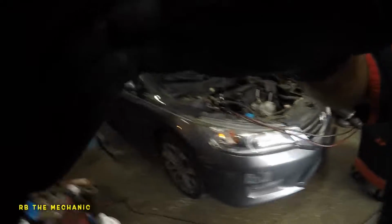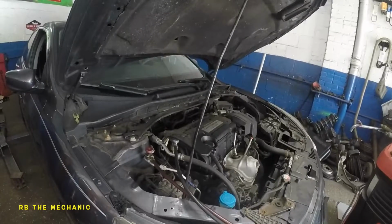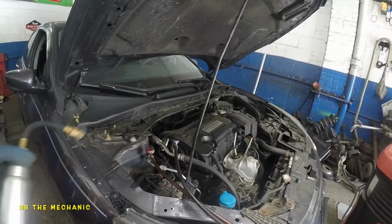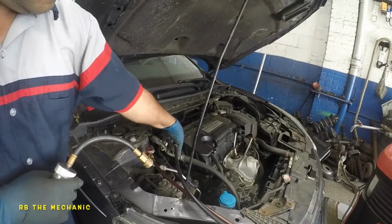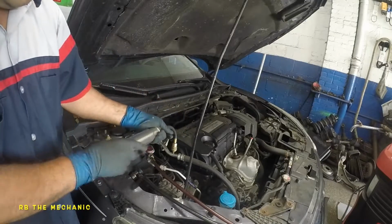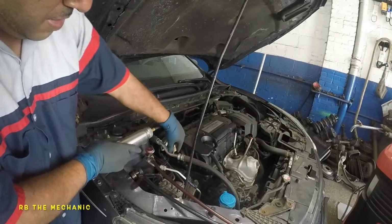What we're gonna do is, let's put our camera back over here again one more time. We're gonna come right over here. So this is how I do it. Every single person has their own way, how they wanna do it. So let's take off this low side. And let's put our oil. So since it's vacuumed, it's gonna just suck it right in. Okay, there you go. Bada bing, bada boom.